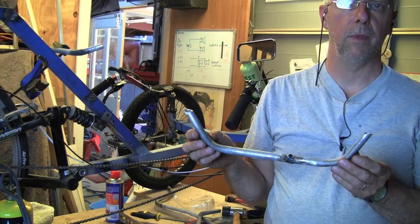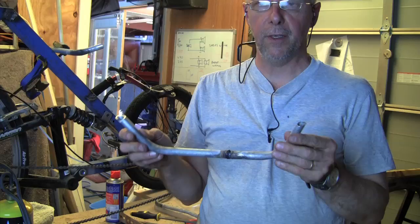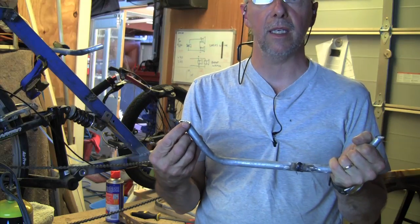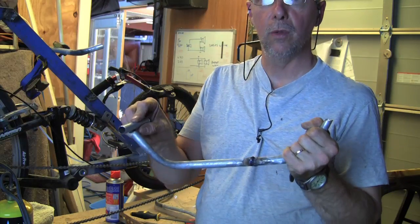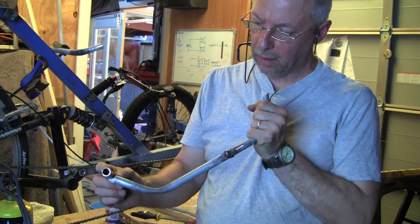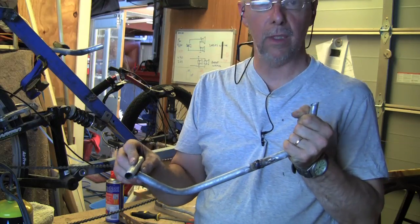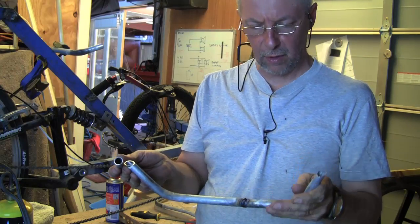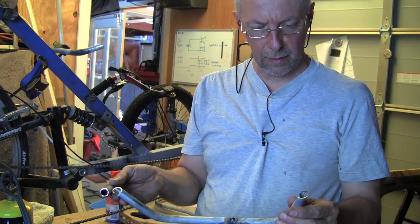These are the two pieces of pipe. What I'm going to have to do is what they call a fish mouth. I'm going to have to grind the sides down here so that the pipe sits into it, so there's hardly any gaps, so that when I go to arc weld it, we won't have too much of a problem, okay? So the next step is to actually put it into the vise and file these things down just a little bit.